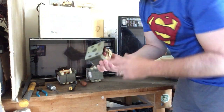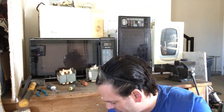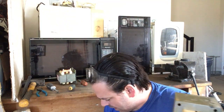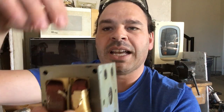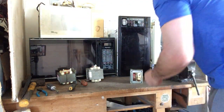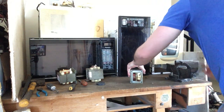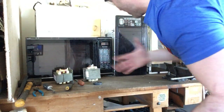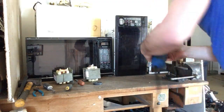I'm going to open this one transformer for this video — it's very easy to do with different types of transformers. Some are electronic ones you can peel off. There's some beautiful copper in there. All I'm going to do is take a grinder, grind down that weld, take a nice heavy file, pry it open. I'm going to weigh this copper for you to see how much is just in this one. Getting my safety glasses and bench vice ready. This does smell sometimes when grinding — my wife always knows. Make sure the door is open and wash your clothes after because the smell lingers. Safety glasses for sure, and I will wear a mask when doing a lot of grinding.